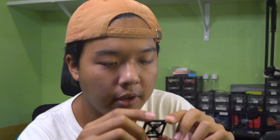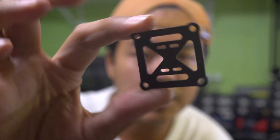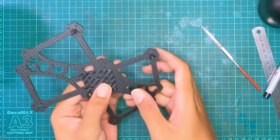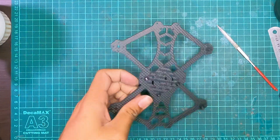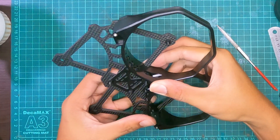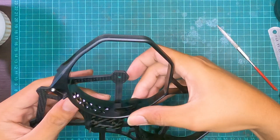How I managed to get my four holes is to try to get one of these spacers. Once you've drilled the first hole, just put an M3 screw through it and continue drilling the other holes based off this one. Please, while you're doing this, put in the prop guards occasionally just to measure that the stack is going to fit and not touch any of the sides of the prop guards as it falls in.